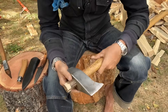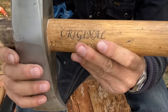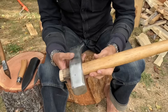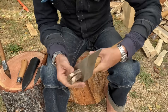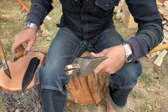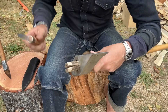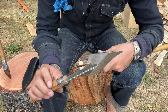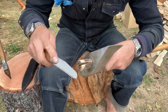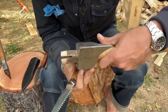We're hard up on the shoulder that I carved out — you can see the fresh wood line there. So we'll take it off and cut the kerf down. The kerf is the gap left by a saw. Very carefully — this is a crude butcher's tool, but because it's such high quality, I think I can cut that. You can see the kerf of the saw blade there.